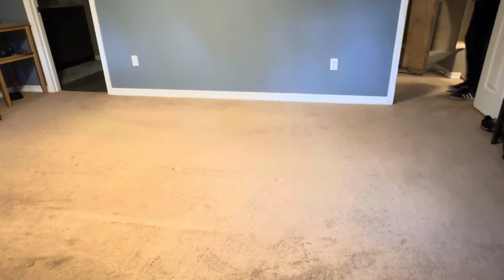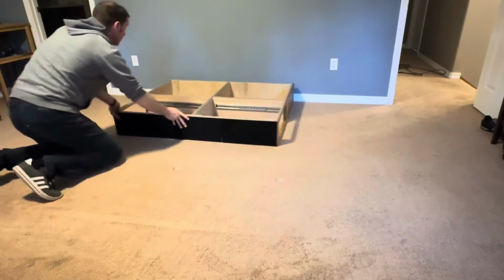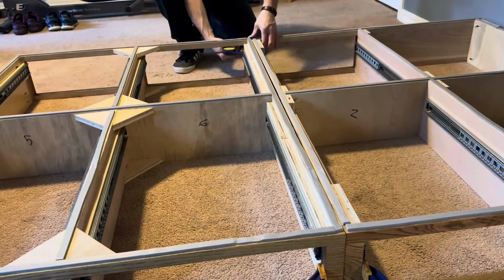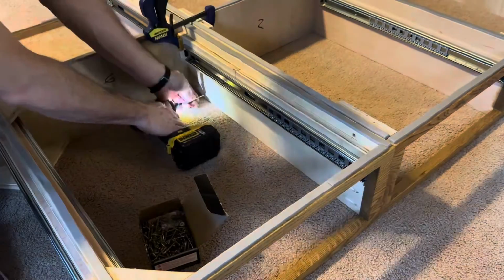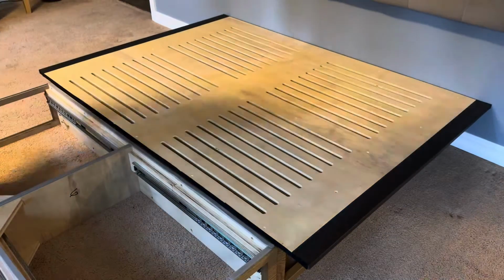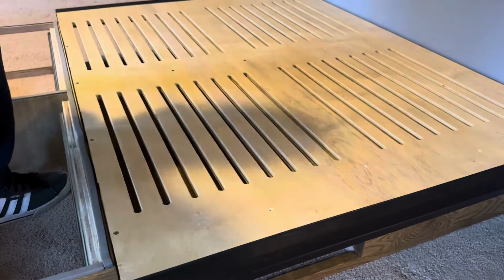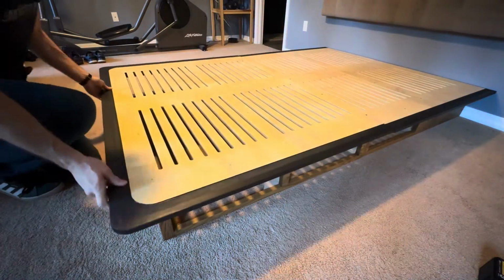Getting the mattress into the bedroom was hard enough, which is why I made the bed in pieces. I was able to navigate the staircase quite easily, even though there were two different landings. I clamped the two halves of the base together and then installed several screws. Next I lined up and attached the platform at the head of the bed. I may have gone overkill on screws, but remember, no creaks. The footboard went on next, and I pre-drilled holes where the screws were going to go right into oak.